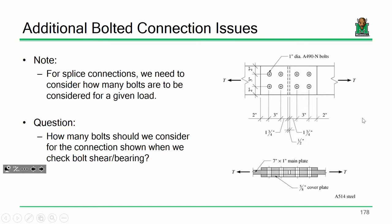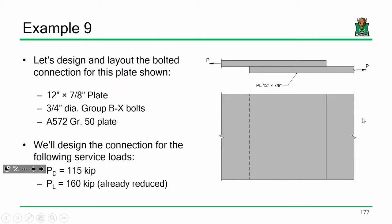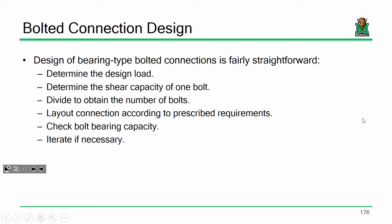Okay, I spent all this time talking about the exam, and it's been a while since we talked about bolts, and I thought it'd be a good idea to just recap what was going on with bolts. And I'm going to start here. If you recall, up until now, we really only discussed two limit states associated with bolted connections. We've either discussed bolt shear or bolt bearing. Now they're pretty straightforward. Bolt shear, we're talking about the bolt shearing in half or snapping in half. And for the plate, we're talking about the plate failing, either the plate or the hole stretching out a little bit, bolt hole ovalization, or the plate literally being torn out. So we have bolt tear out and bolt hole ovalization.